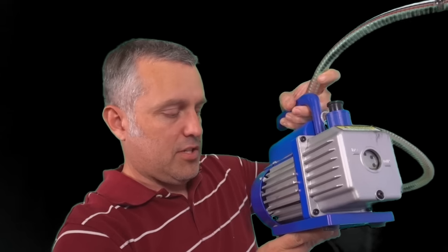If you have filament that's going to sit for any period of time — if you're not a large production shop blowing through filament — you need a vacuum dryer for great storage. This is the vacuum pump that allows you to suck the atmospheres right out of that pot. A quick tip: put a little of the oil from your vacuum pump on the silicone seal. That will help the vacuum pot stay under vacuum for months, keeping your filament dry.